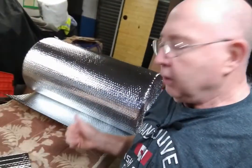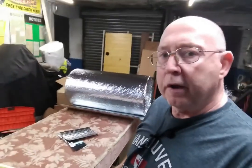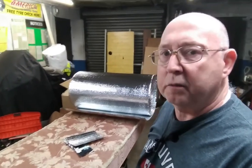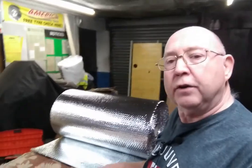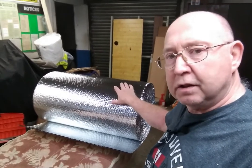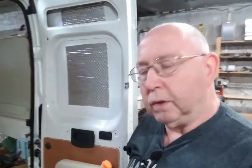The reason I'm flagging this is I've seen people on YouTube calling it insulation. It has very very slight insulation properties but not really anything to mention — it's for vapor barrier. So don't use it as insulation because it's virtually no good at all for that, but do use it as a vapor barrier.